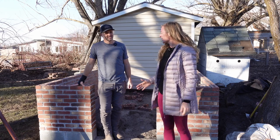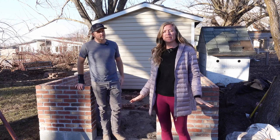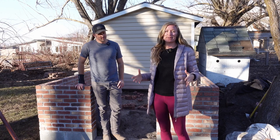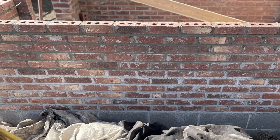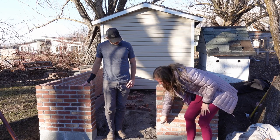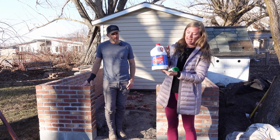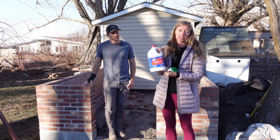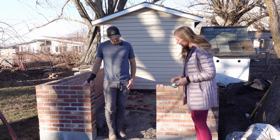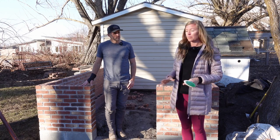We got our brick done — this is really exciting. I have to admit, I started out super strong on laying this brick, and then I kind of abandoned my husband in the process because I got distracted weeding some of my flower beds while the weather was nice and the soil was soft, but I kind of knew I was going to be the cleanup gal. As you can see, the brick has quite a bit of mortar on the edges that needs to be cleaned off. So what I'm going to do is grab this muriatic acid, dilute it in water about ten parts to one, get a scrub brush, and go around carefully. I need to let it all dry and cure, and then I'll scrub it off — that's the next thing before we move on to framing.